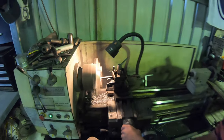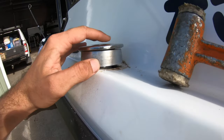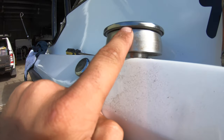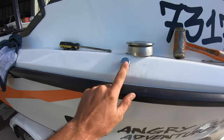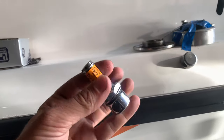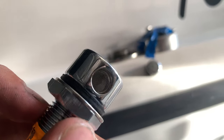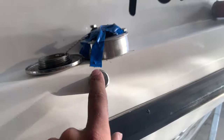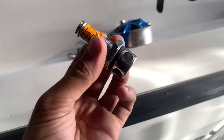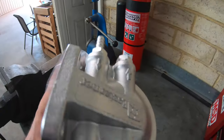I also got a new fuel cap. The old man actually made this on the lathe last night — the new fuel cap sits just a little bit higher, about 15mm, so no water is being forced inside. We'll bolt that down today. We also got a new breather. I went to the boat shop and bought a new one, and check this out — these ones here have little mesh filters, whereas the old one doesn't. That's just another example of where water could have got through. I'm definitely going to put a new one on, but I need to work out a better location because I think the current one is a terrible location.